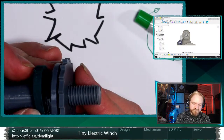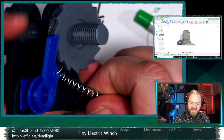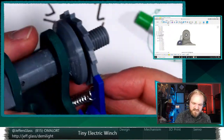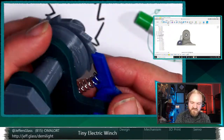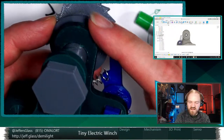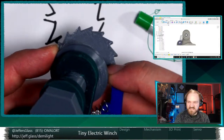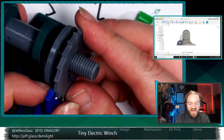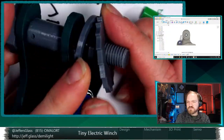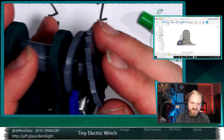What if this would even be made more compact if we imagine that this spring, instead of being attached here, was attached to a second moment arm that was attached here. Right, so we just have a little spring that comes off maybe from this part of the frame down to the arm, and that's what's providing this tension. And then the spring actually doesn't need to be in the same plane as the ratchet wheel at all. Right, it could be offset on a shaft that was off to the side there. And then this whole mechanism gets shrunk in somehow.